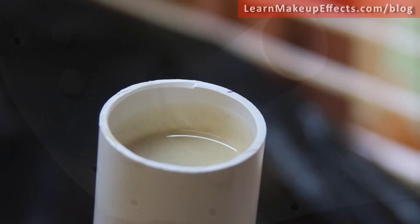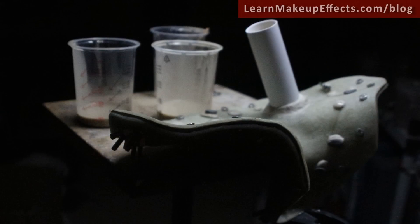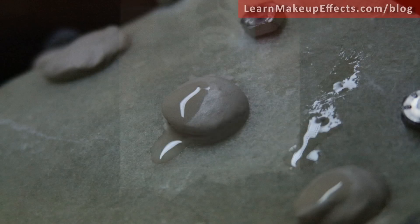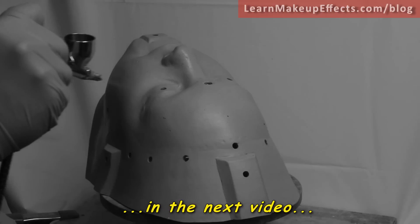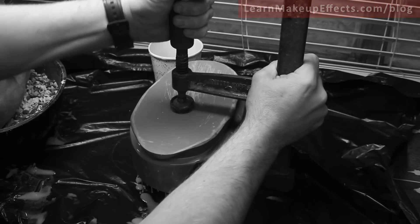Here you can see photographs of the final pouring process — the tubing in place, silicon mixed and poured gradually, bleeding through. When all the bleed holes show silicon running out, I can be pretty certain the whole thing is filled. I left it for about half an hour, blocked all the holes, and left it overnight. It was fortunately a successful cast — the first one out was absolutely fine. This wraps up this video. The next video will concentrate on how the pieces were actually run, how cores and everything were prepared, cap plastic sprayed on, and silicon mixed and poured — and we'll also focus on the ears. Thanks very much for watching.